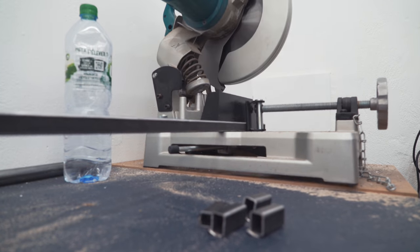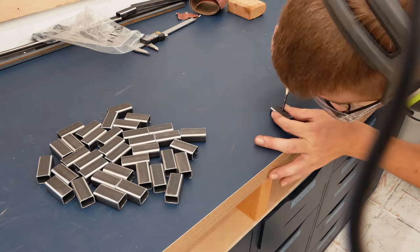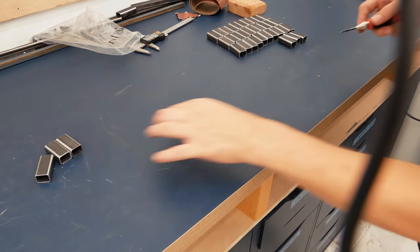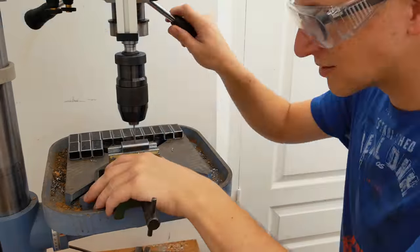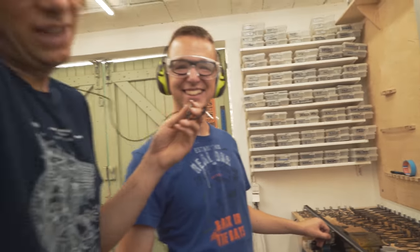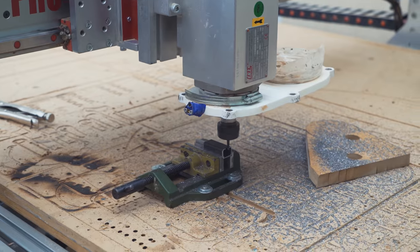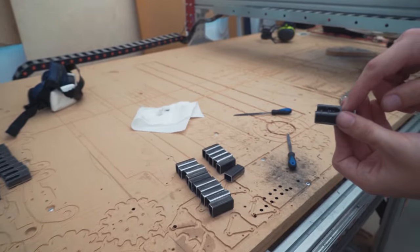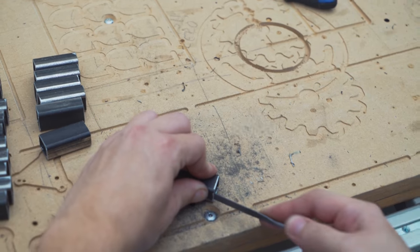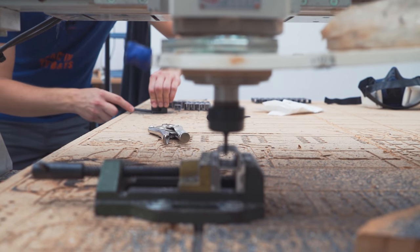I'm preparing stock - cleaning it up where I will weld it before I cut it, so I don't have to clean the part 37 times instead of only one time. Then I will cut it to length, cut the slots in the parts that we need, and then weld it on these plates. I'm preparing those square tubes I cut earlier. The machine knows where the part is and it's always on the same spot. Because there's a little burr left, I can deburr the part I just made while the other part is being made - the time is pretty much the same, so that's perfectly efficient.